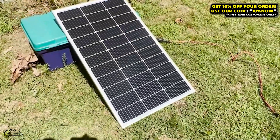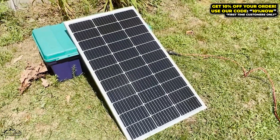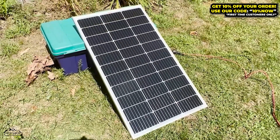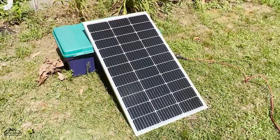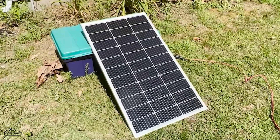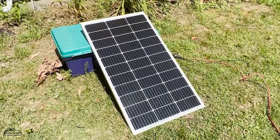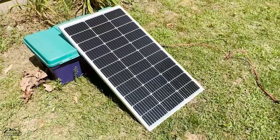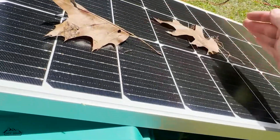What I want to show you is that right now the panel is 100% in the sun — there's no shade on it, I'm off to the left, not covering it — that's why it's getting 82 watts. I just want to show you the power of even just one cell in this solar panel getting covered. This is for people that live in a place with four seasons where leaves fall off trees, to make sure you are cleaning your panels and making sure there's no debris, no snow, nothing on them. I have my little leaf pile and we're going to put a couple leaves on there.